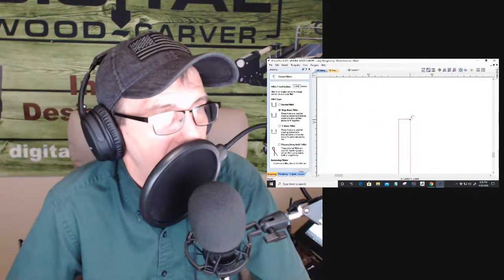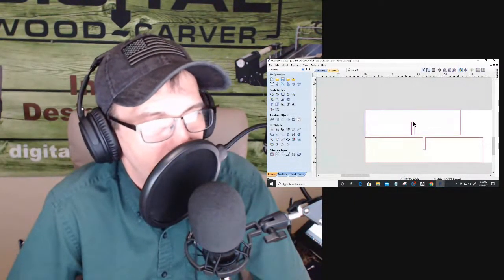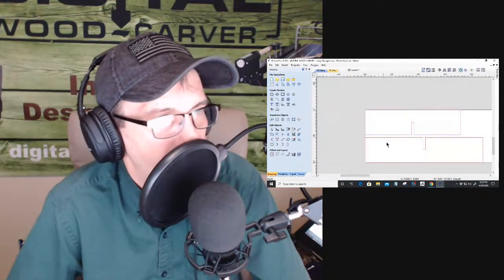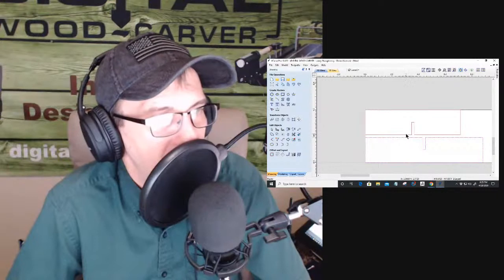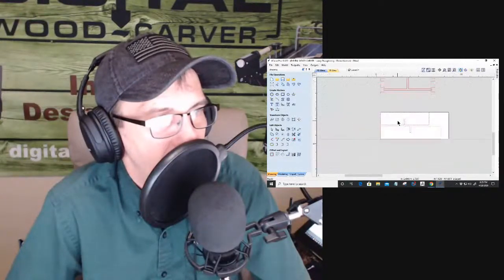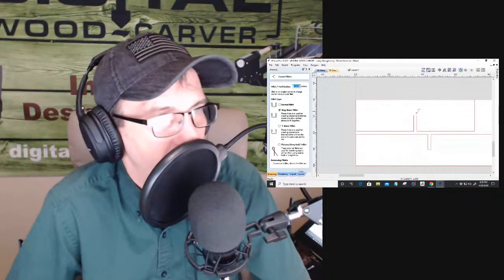Can't do anything with that. Why can't you do anything with that, Lainey? Why can't you click on that? Because the part is grouped. The part is grouped. We have to ungroup it. Okay. Same thing with this one. We got to ungroup it and make sure there's no overlaps or extra pieces and any of that stuff. Doesn't look to be. Got a nice white dotted line behind there. So I should be able to come in here now and create my dog bone fillets.